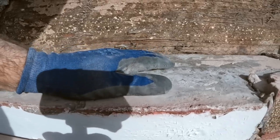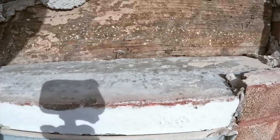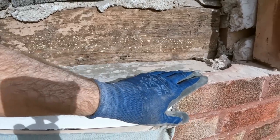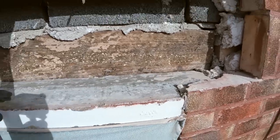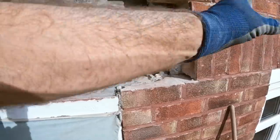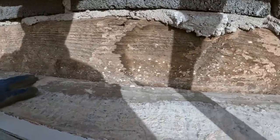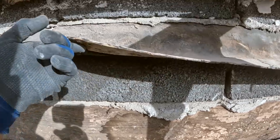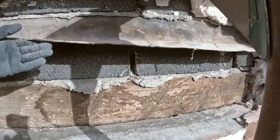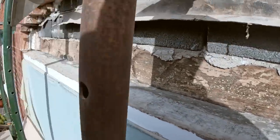The other option is take this thing out, but if we take this out, we're going to lose the plaster inside. We're going to need a whole other course of bricks. Bricks are discontinued and it'll look odd with this, like a row of different bricks. Plus you're going to lose the feature of the white block above the doors. So I'm going to recommend to put the lintel in it and then just put back as it is, new tray, and then get it put back. You can see where the tray is up here, up above the soldiers. But yes, that's where we are now.